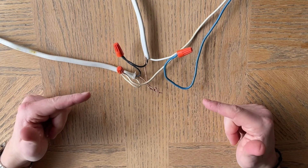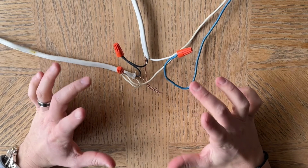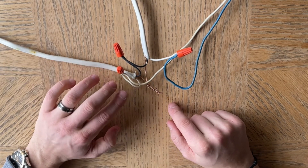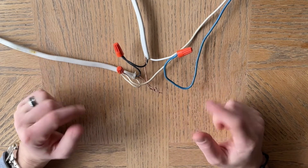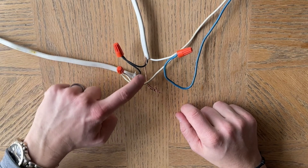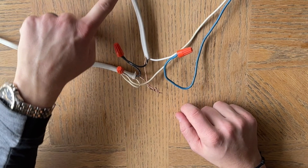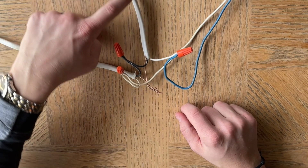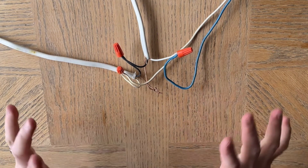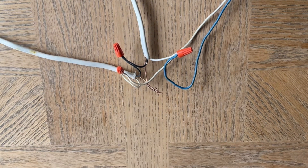So this is it — that is how to wire sending power to your light switch if the power is up in the ceiling. If you have any questions or comments, please comment below. Remember, this is the live wire with live power coming in, going down to the light switch, where the switch is going to send it back up to the fixture. Any questions, please comment below. I hope you like this video — hit that like button and subscribe to stay tuned for future videos. Thank you.